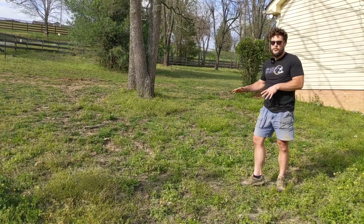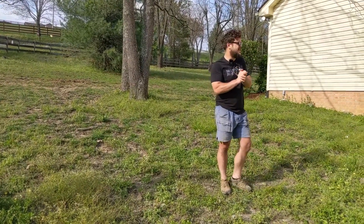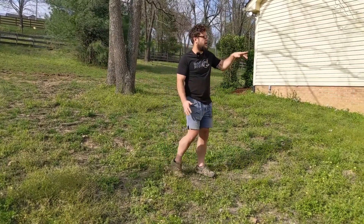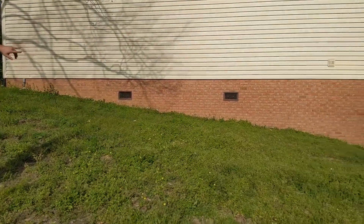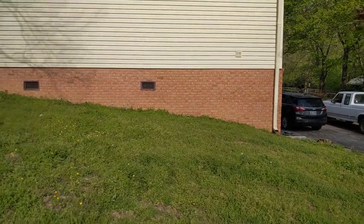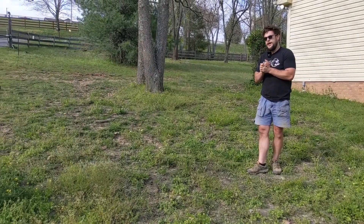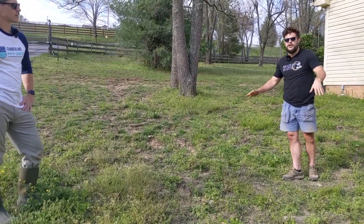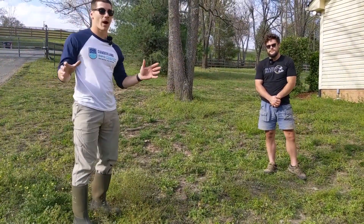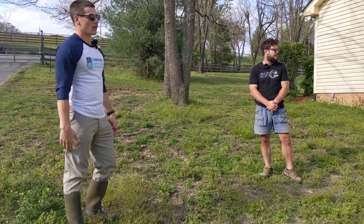If it's not super obvious in your yard where you can tell where the flow is coming, you can often connect to downspouts. The downspout behind me looks like it's attached to a French drain, so that wouldn't work. The downspout beside me looks like it's directing close to the foundation and near the driveway, so we'd want to stay away from that. You always want to make sure you're at least 10 feet away from the foundation of your home or your neighbor's home when you build a rain garden.